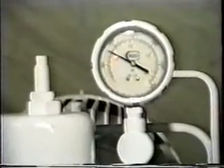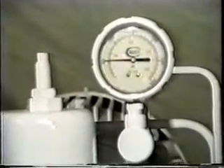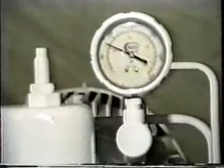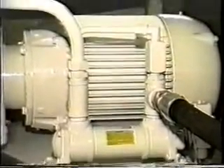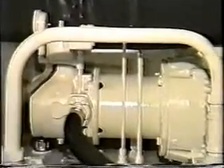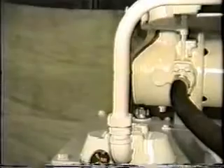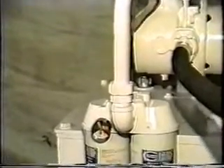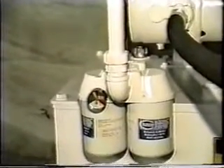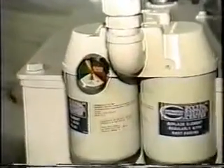The use of oversized reservoir tanks assures both adequate fluid capacity and cooling. A pressure gauge is included on each hydraulic power pack providing process feedback. Oil-water heat exchangers are standard on Alloy Ramvayors to avoid shutdown due to overheating. The Alloy system has both over-temperature and low-level shutoffs for added operational safety. Alloy incorporates dual in-line filtration on the oil being returned to tank and includes a gauge for easy identification of clogged filters.